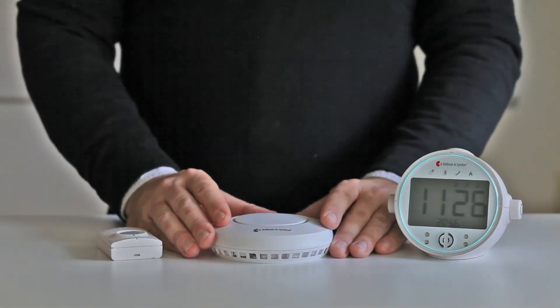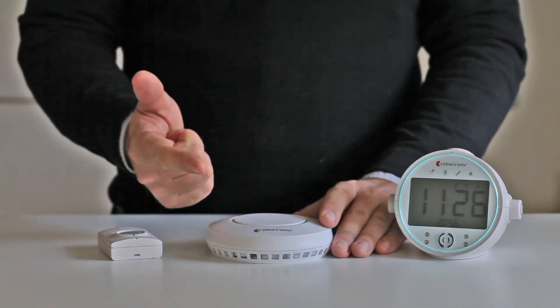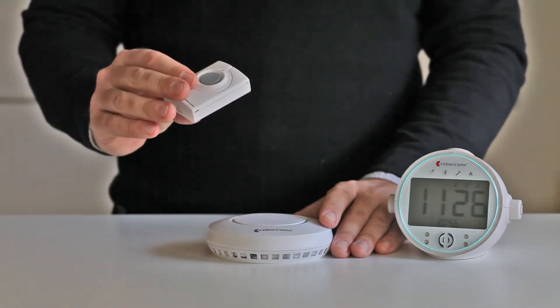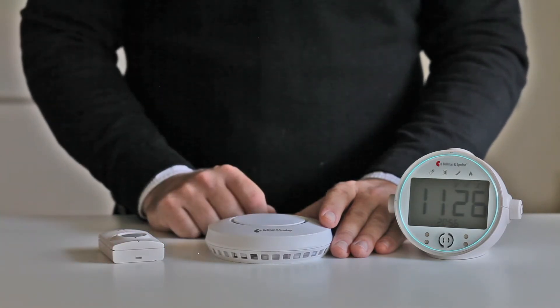In order to do so, we do it in three steps: we remove the battery, we place the smoke alarm into a listening mode, we then activate any of the other transmitters, and we confirm the choice with the smoke alarm itself.